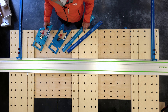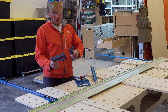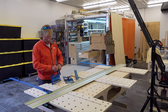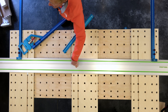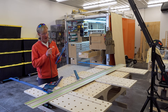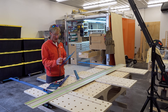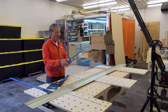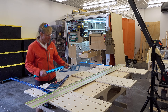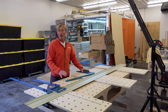The rails — all the different sizes — will also fit on the guide rail squares from TSO. The GRS 16 is for the right-hand side, and you take the right-handed scale and it goes on exactly the way the other attachment does. There's only one way to put it on — only one set of holes that line up. If you told me I can have all the tracks I want but only one accessory, I would choose the GRS 16, and I would choose their PE version. The GRS 16 works for the right-hand side, but the PE has holes on both sides squared, so I can mount the rail and use it on the left-hand side or the right-hand side. Often you'll see a kit where a person has both — this one on the left and this one on the right.